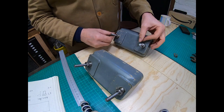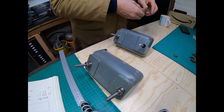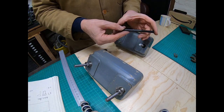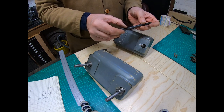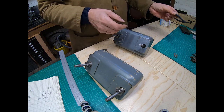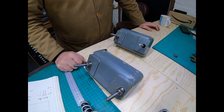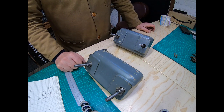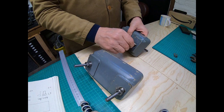These are just simple studs — if you buy the riser block second hand you can get them from Myford. They're slightly longer on one end with a plain unthreaded area and smaller on the other end. Unfortunately these were too short for me because my workbench was too thick, so I just bought some bar and tapped the thread myself.